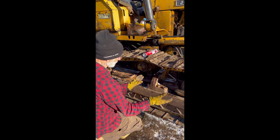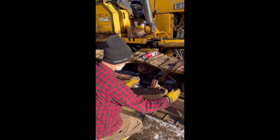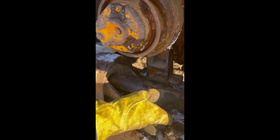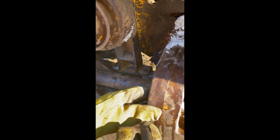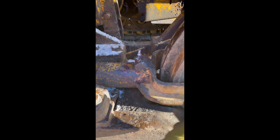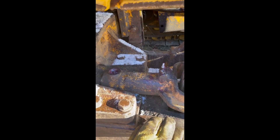It's not too complicated for that. These two parts just come apart. You've got the piston and then the receiver part of the piston. The piston goes in here into a spring setup inside here — that just comes out. Sometimes you have to pry it out, but we didn't have any problem getting it out. You can put a pry bar in here and pull that whole thing forward, slide it forward. It comes out not too bad once everything's apart.